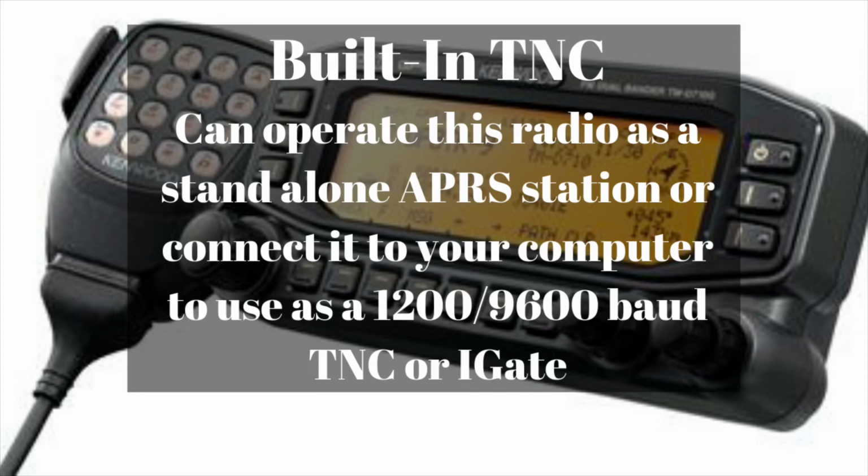This also has a built-in TNC, a terminal node controller. Now, this can be used for APRS, and with the combination of the TNC and the GPS, this radio is a standalone APRS system. You don't have to have anything else in order to use APRS. You can also use this for doing packet communications. You can hook this radio to your computer and use it for packet, or use it for IGate terminal operations.